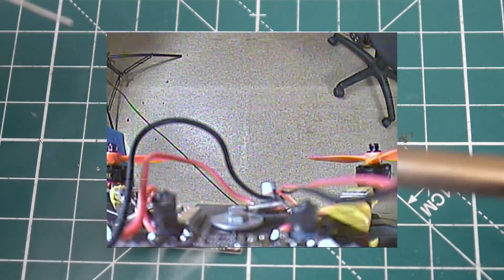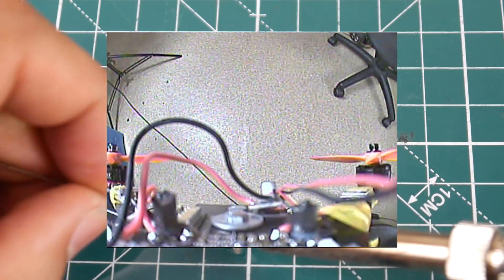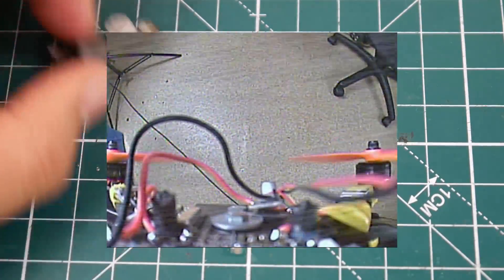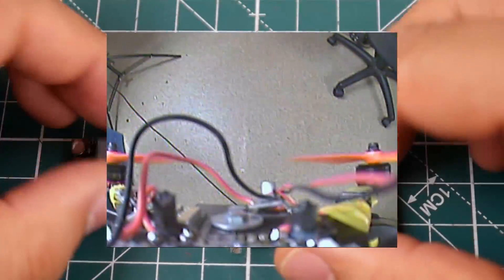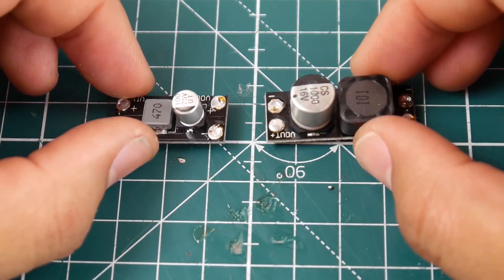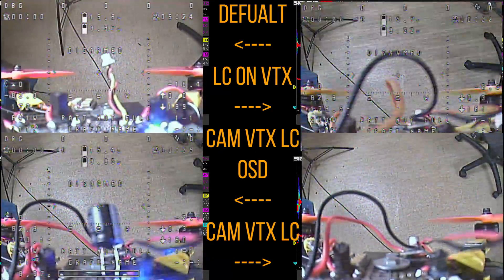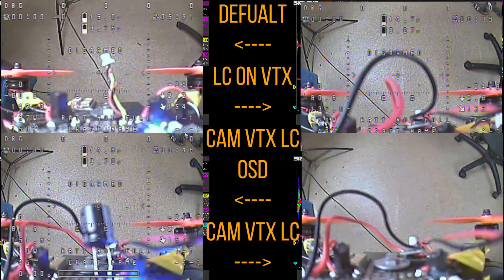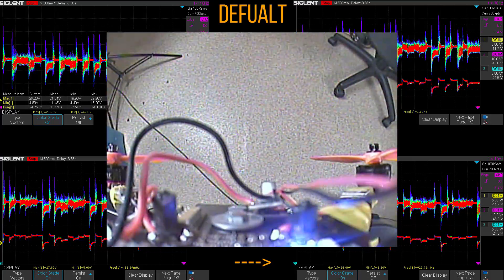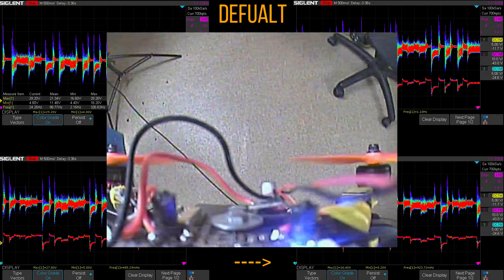Next I connected the camera and VTX directly without the OSD, with everything going through the LC filter, and the noise was still there. I've boiled it down to one thing: even though the LC filter is cleaning everything on its output side, it's ruining everything before it. I think the voltage fluctuations from the voltage regulator inside the camera are really affecting it - the camera is more sensitive to voltage fluctuations than a VTX. To prove this I have a couple of methods planned for part two.